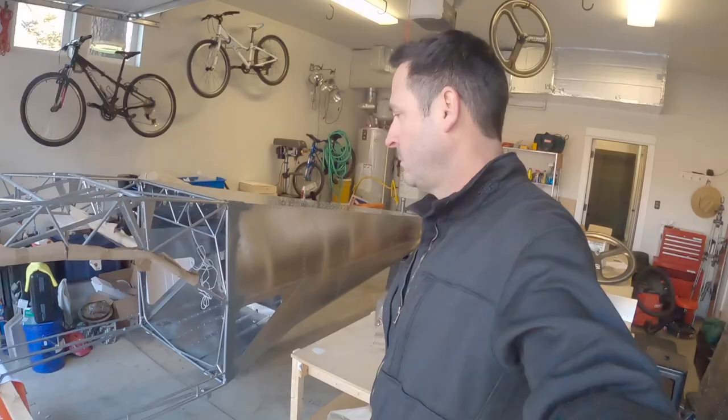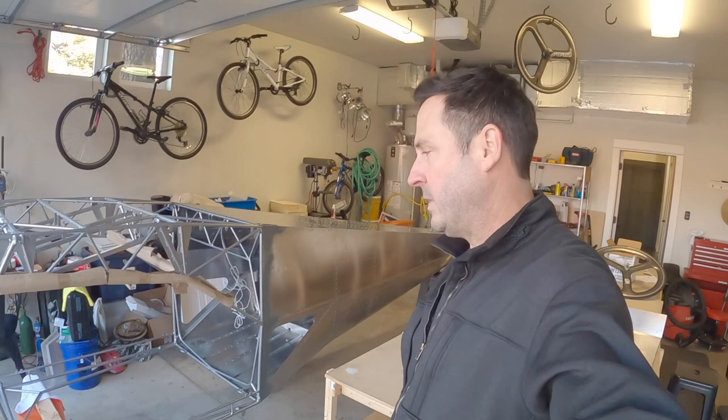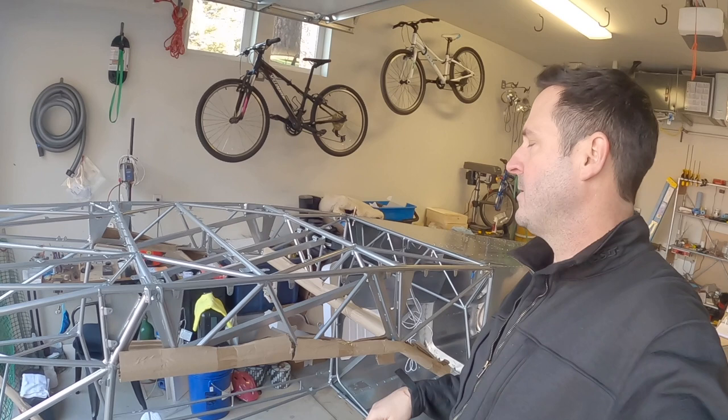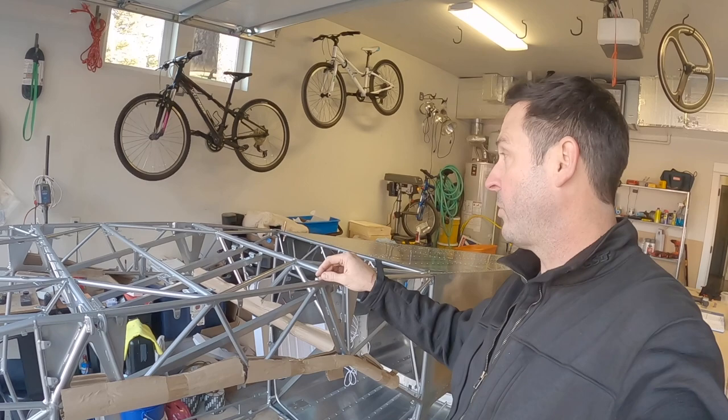Thanks to Biker Bill for his help to flip this over. The next step is to get the seat rails in and ensure that the bolts are clear for the seat belt attachments. Just taking a drill and making sure that the powder coating didn't prevent the bolt from going through, and then you can fit up the belly skin. So make sure you get that done.